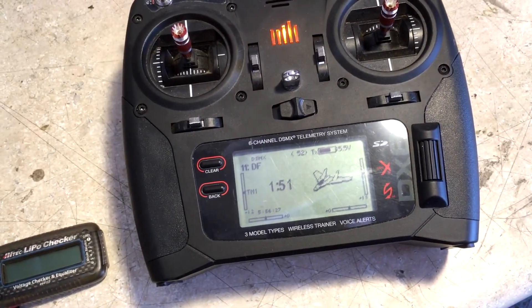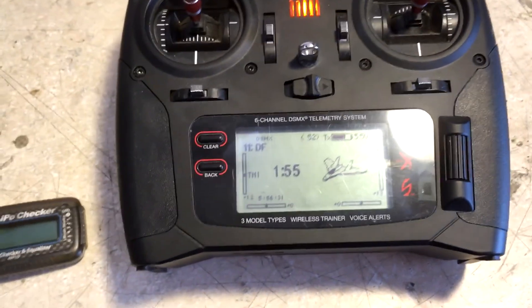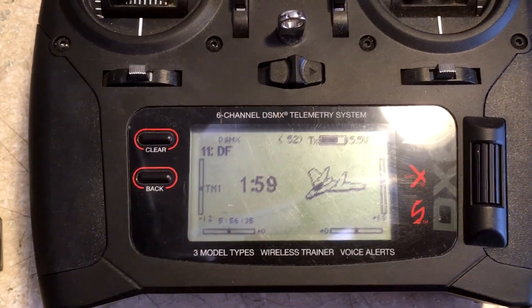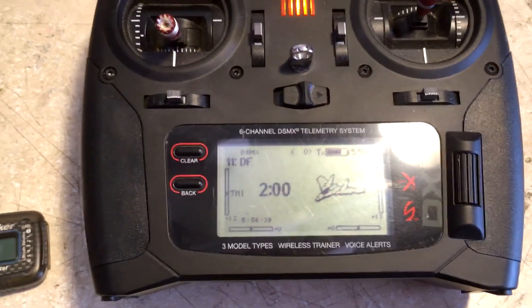What I've done now is I've outfitted the airframe with a DJI 2212 motor — that's off of a DJI Phantom 2 — and that draws about seven to eight amps at max throttle, which in turn obviously provides a much greater efficiency.